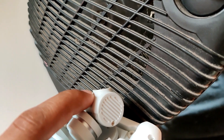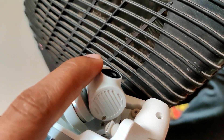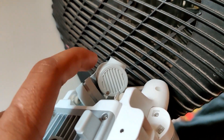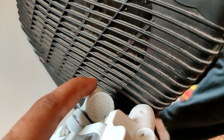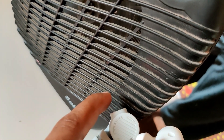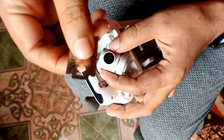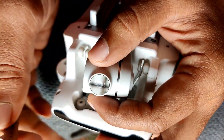Use the side of the heater, not the main front. Step one: turn on your hot airflow and carefully heat your drone camera lens. Make sure it's not overheated or underheated. I recommend 50 to 55 degrees Celsius temperature. When heating the camera lens, make sure to only heat that specific area, and keep your hand on the camera glass — when it's too hot, take it away from the hot airflow. Heat the lens for about two minutes, then use your blade to remove the camera glass.